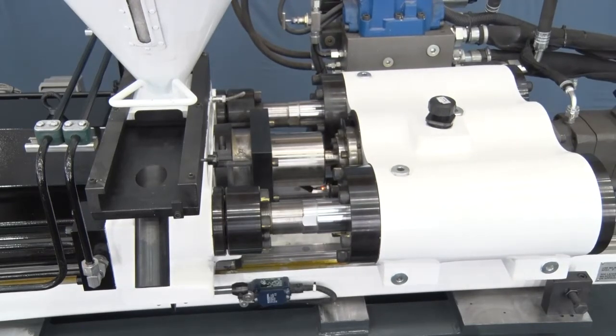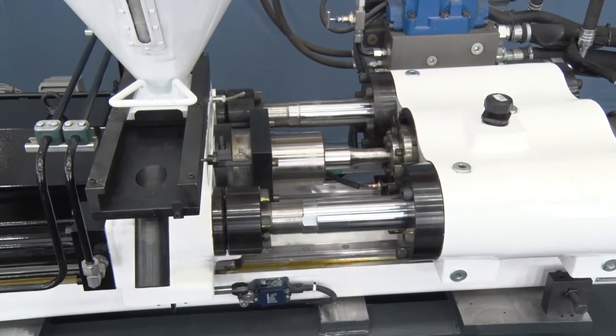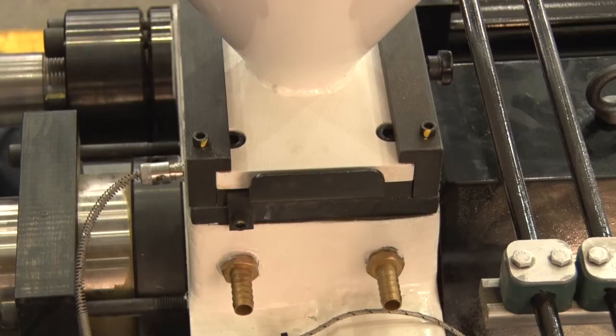When it is visible, the melt coming out of the nozzle is finished, stop the screw rotation and retract the screw minimum equivalent to screw diameter to release the screw tip from melt envelope. The feed throat cooling should remain on. If the shutdown is only for a short period, now the machine can be totally shut down.